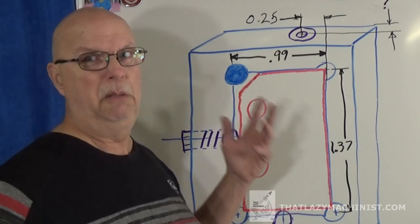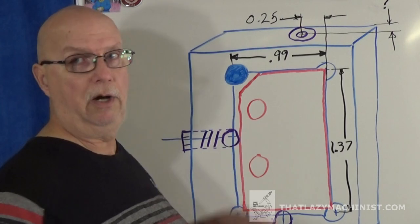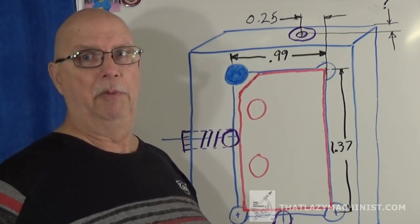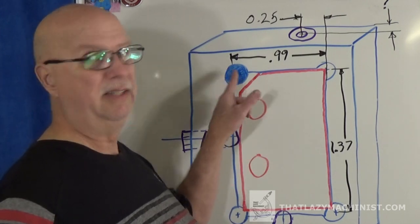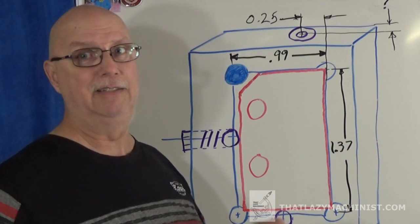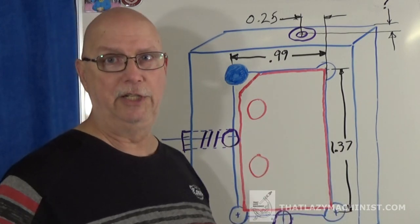So it's going to be the same style of foolproofing that we used in the first jig. Now if these holes are offset from one side to the other, and they could be, I don't remember what the drawing was, but I could use those to foolproof my jig, but really this is the simplest way because that surface, that angular surface, is already there. So let's go find our part and we can start producing that jig.